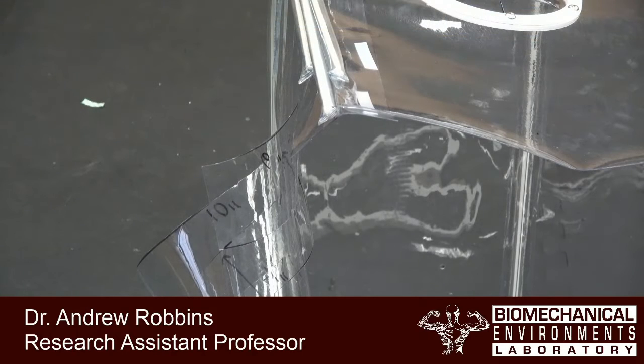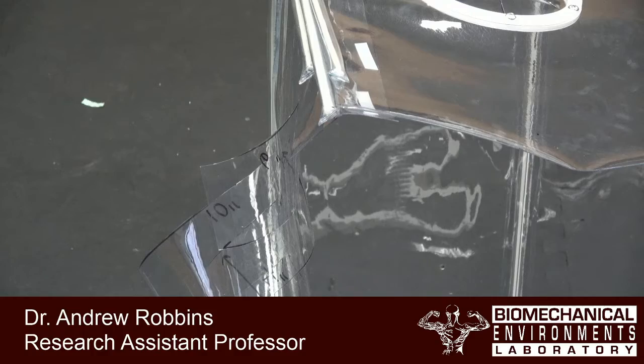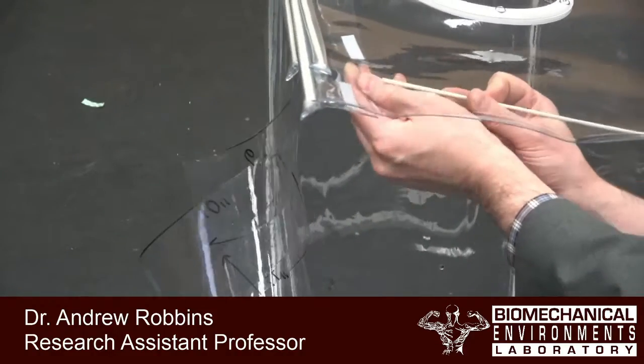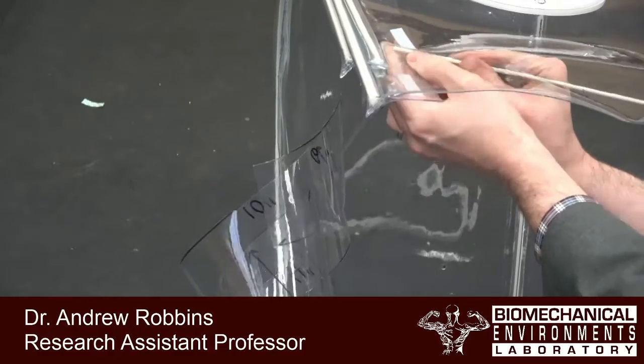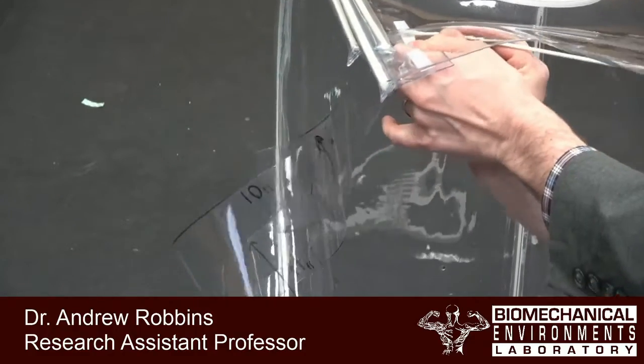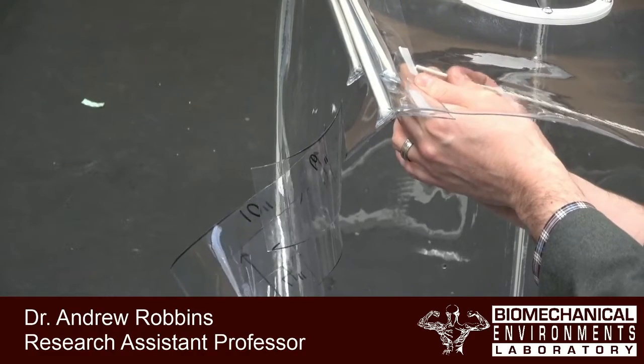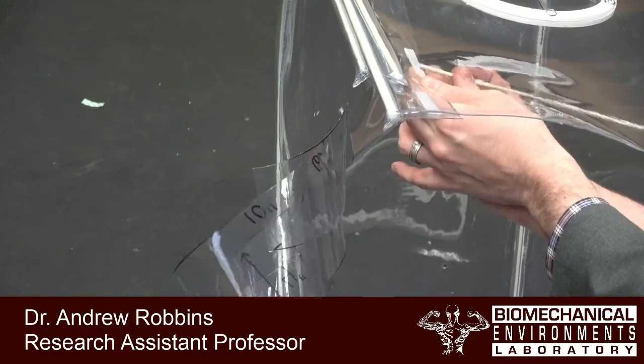So here you can see some of the double-sided tape that needs to be removed from the inside of the device. So for the tape that's stuck between the pieces of vinyl, using a thin rod to separate the vinyl can be very helpful. And then you can generally peel off the tape.